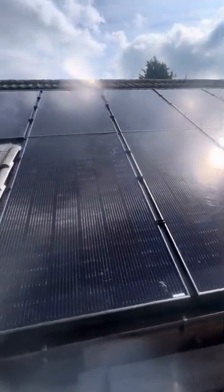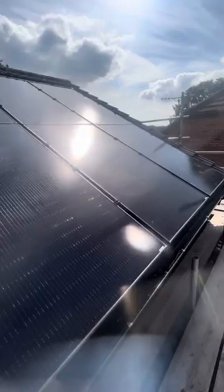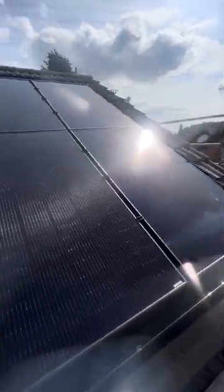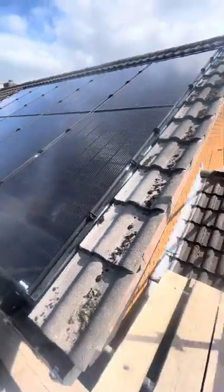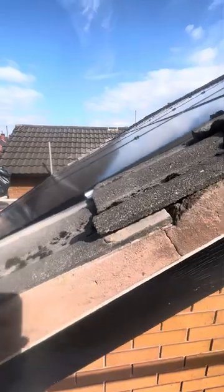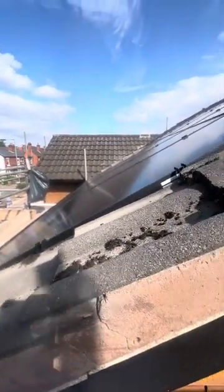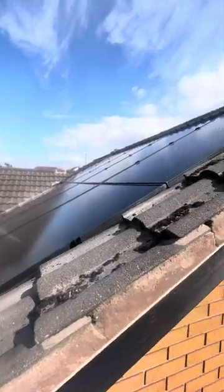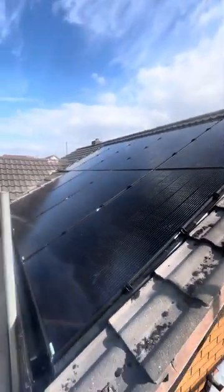With a slate installation, the slate itself would roll up onto the tray, which doesn't give as nice a finish around the perimeter of the array. But if you have a quick look from the side elevation, when that's mortared up, the profile of the tile finishes perfectly flush with the edge of the panel.